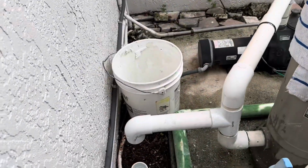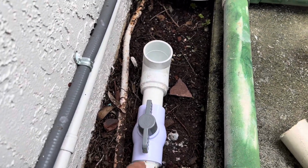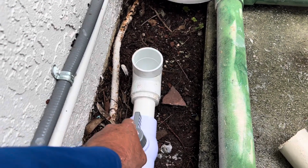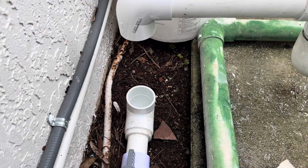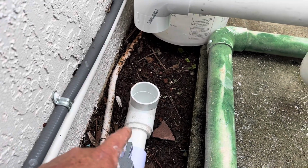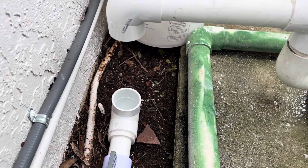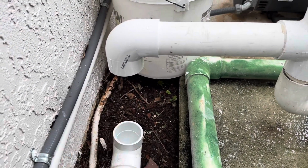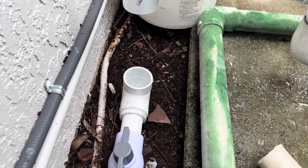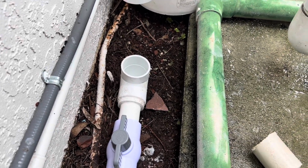All right, got my outlet pipe coming out. I built up my rig. I don't have the valve glued in yet. This is just to give me an idea of where everything is going to be laid out. My elbow is glued into my bushing, and I do have the pipe glued into the bushing there, and I get my exit pipe glued into my valve. So now I'm just going to measure the distance between here and here, and then we're going to finish up this loop, and then we'll add our blue hose to our other pipe that we have here.